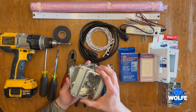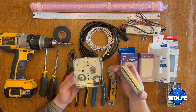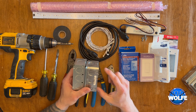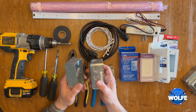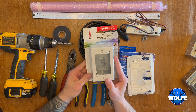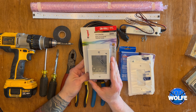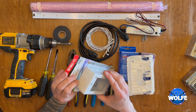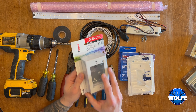For materials, this electrical box is a possible option but you'd need a special face plate and I don't like the way it looks. These two smaller ones aren't deep enough to fit everything you need. What I ended up using is a box that's seven or nine dollars from Home Depot — there's plenty of room for all the wiring, plenty of depth for the occupancy sensor, and it has knockouts where you can fit the wire through.